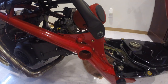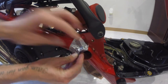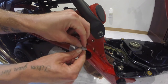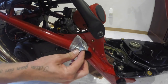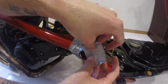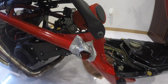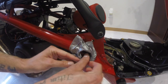I'm not too worried about cleaning off the glue or stickiness - it's not gonna pull anything off because it's powder coated and on there real good. If you use painters tape or masking tape, make sure you put a few layers on there, otherwise one little bump and the bit goes right through the tape. I've also got some wax on mine so the tape doesn't stick real well, which is actually gonna work in my benefit - when I pull it back off it shouldn't be too bad. I'm just gonna stick a bunch of tape on there and protect this lip.